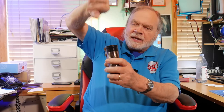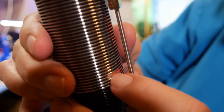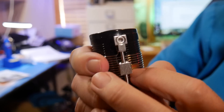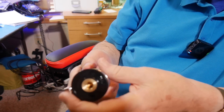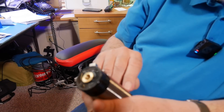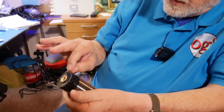I want to mention this coil. It mounts with this end down and the whip antenna screws into this end. Notice the marks on the coil — this one is where you put it for 40-meter operation, and this mark with the gold band is for 20 meters and above. So there are really only two positions. It's very difficult to move, which ensures good contact. Now, this coil is made of stainless steel. Other manufacturers, like Wolf River Coils, also make their coils with stainless steel. There's an issue with that — measuring from bottom to here, the resistance is five ohms. If it's on the 20-meter setting, it's one ohm.